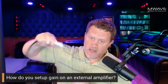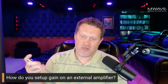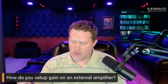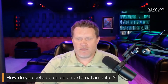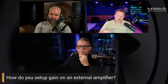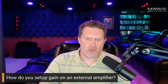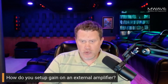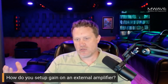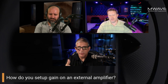They also come in RCA. If you have too much signal and you're already at negative 12 but still can't calibrate to reference level because it's too loud, use these inline attenuators. If you have the opposite problem and you're going into the positive range — like positive 2, 3, or 4 — that's not ideal. In that case you should buy a voltage booster. A product popular in the forums for years is the ART Clean Box Pro. You can use that per channel to boost your signal so you don't have to go positive on your trim levels, which helps avoid input clipping.